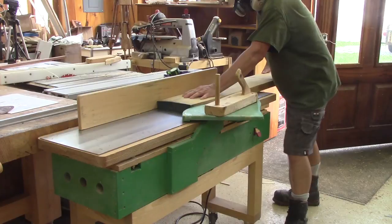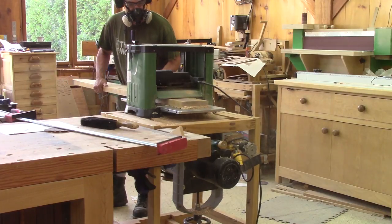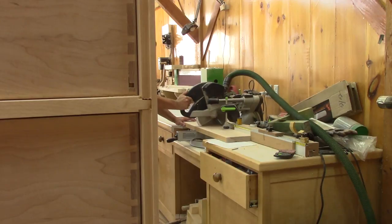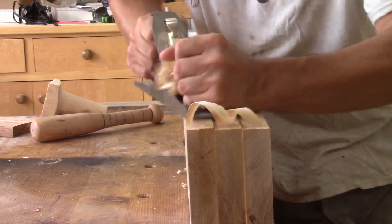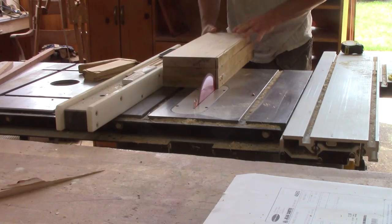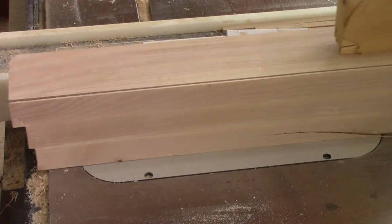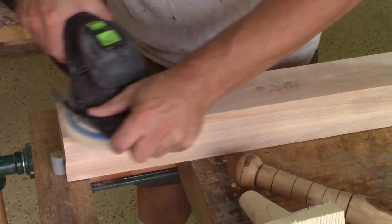But not the dresser — I need to surface more wood for the legs. Now that the wood is smooth, I need to cut this in three and glue them together. Finally, I just need to wait for the glue to dry. The next morning, I make sure there's no big hard glue drips that can damage my jointer knives. When I'm satisfied, I joint one side straight, then I cut the other side. With four nice faces, I can cut two square blocks. Before going any further, I remove the burn marks and cut six identical pieces.